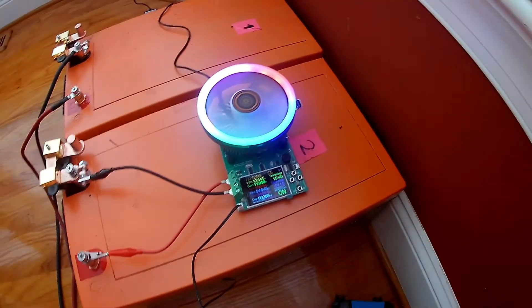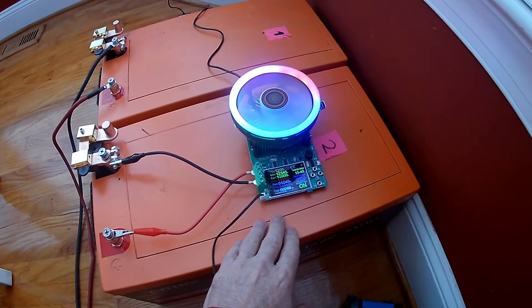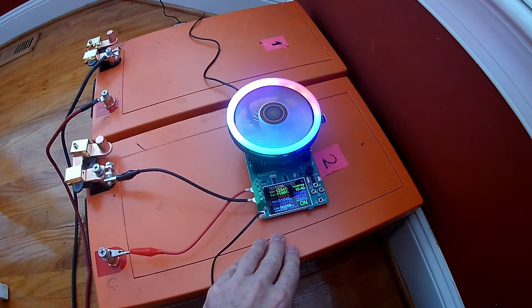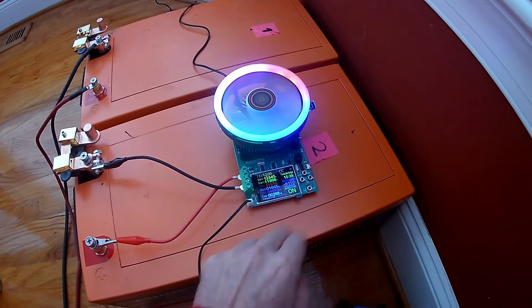Keep in mind that this is plugged into your regular household outlet, and outlets are basically 15 amps. So to keep it on the safe side, you don't want to go more than 15 amps anyway. Don't do the math using 20 amps, because you're going to say 300 amps divided by 20 is 15 hours — but no, because I'm only using 12 amps.